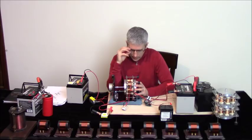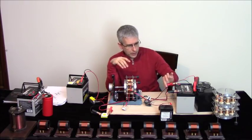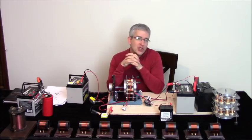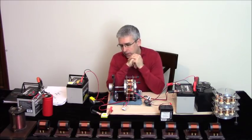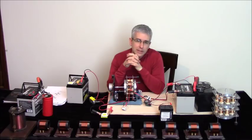in the Loving Path series, we have on the output going to the charging batteries, which is the bigger, thicker wires here, this battery. On the way to the output, we have, yes, series resonant circuits. There we go, there's the cat out of the bag. And actually, I wasn't even showing resonance in any of the videos. You can even be out of resonance and still get a really good result. Sometimes, like in my meetings, I was showing the box running in resonance, in which there was a really high output, and it also blew out the whole motor because there was too much power.